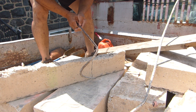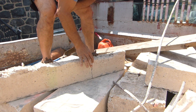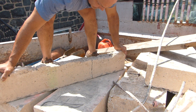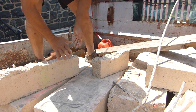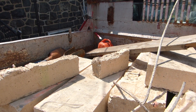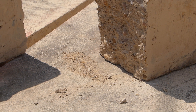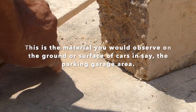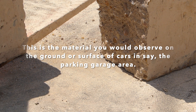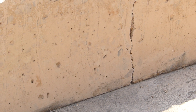That's why all cracks must be addressed. You can observe them, watch them — some of the reasons they are wider is because of the compression. I didn't do anything here besides grind it a few times, and now all of a sudden I've got this stockpile of stone. There's a stockpile of stone in the joint stopping it from closing back up — that's got to come out, or at least be out of the way. We get this joint back nice and tight — she's nice and tight now, it's a much better looking joint.